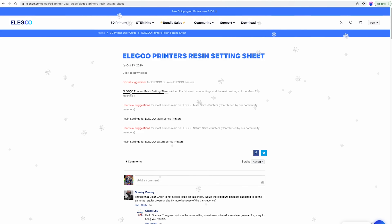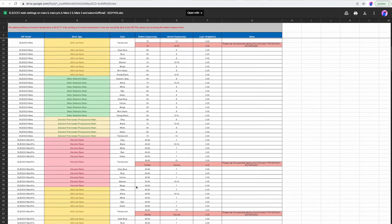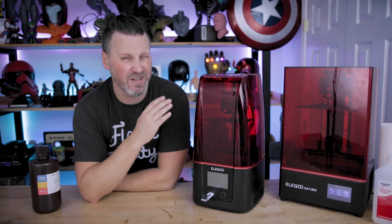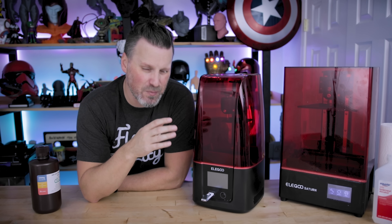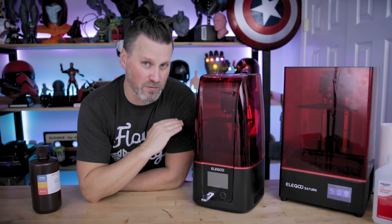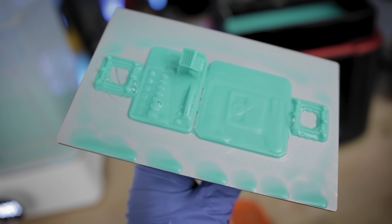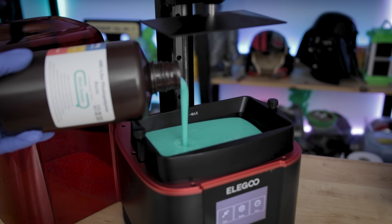One great thing about Elegoo is that they have a set of standardized profiles for all of their resins and all of their machines that are available through their website — I'll have links down below to that as well. That's a fantastic starting point. But in general, when it comes to exposure settings, regardless if you're using ChituBox, Lychee, or PrusaSlicer, 2.5 is typically where I start with my exposure testing and then increase or decrease from there. And in a lot of cases, if it's a mono screen resin 3D printer, I'll typically start dropping it down below that 2.5 exposure setting. One of the best parts about these exposure tests are that they don't use a lot of resin and they print relatively fast, though you're likely going to want to rerun those same prints multiple times to determine what's best for your printer, the resin, and the print space you're working in.